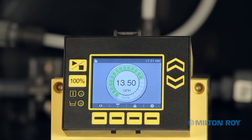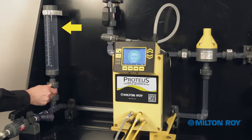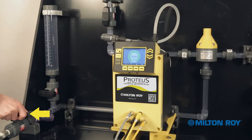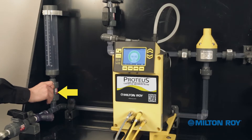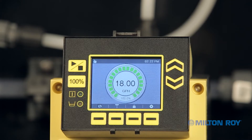If the green LED is illuminated, the pump is operating, and when the LED light is off, the pump is stopped. Once you stop the pump, fill your calibration column. Then take the pump out of service by closing the valve to the reservoir tank and open the valve to the calibration column. Be sure to make note of the starting fluid level.